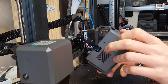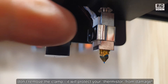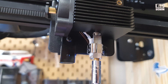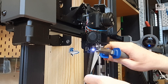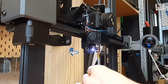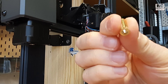Two screws and then you just remove the silicone protection. You see the little clamp that holds in place the heating element — the little white part. This is the inductive sensor for the Z offset. Heat up the nozzle, use a 4mm tool and screw it clockwise because it's upside down. Hold the block with the clamp but don't destroy anything. Remember this nozzle will be 200 degrees hot. This is the 0.8mm nozzle that I installed — it cost me 2 euros.